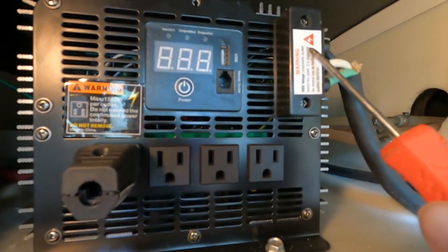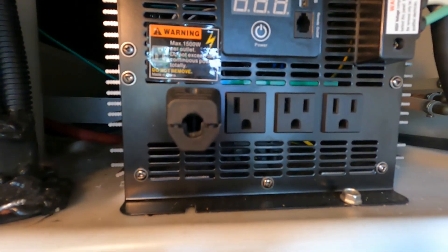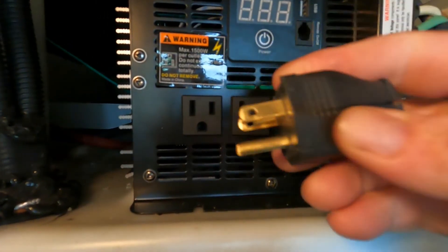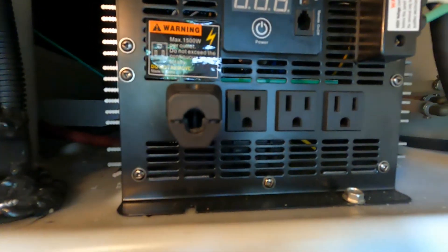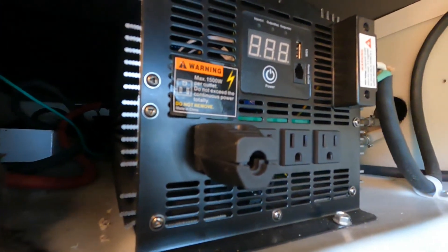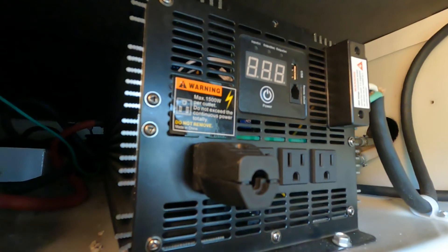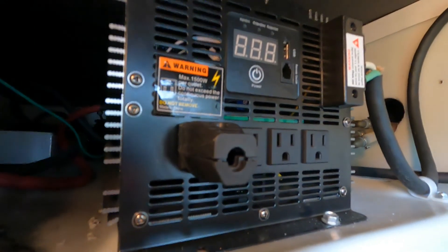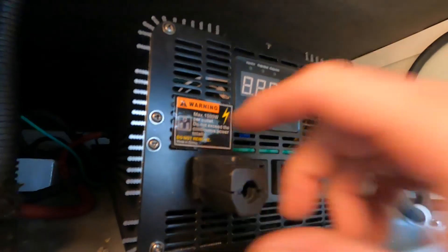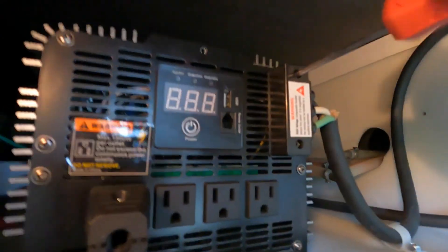One of the reasons I chose this inverter is because of the hard-wire option — hard-wiring in a separate outlet that I can plug our 30-amp adapter into, rather than running extension cords. This is to give you ground, because our power management system without that ground tie-in will show a ground fault. Basically this plug is wired inside to connect the neutral and the ground together to fool the energy management system into thinking there's a real ground. That's a long discussion about electronics and grounds, but this is the standard way to get past that issue.